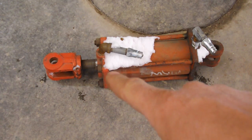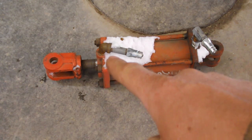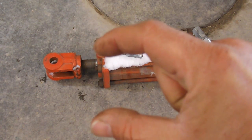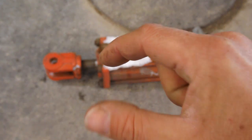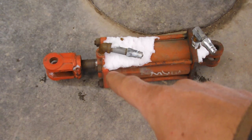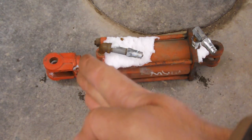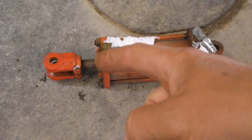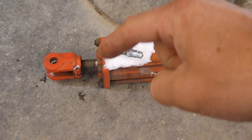What I want to do is basically take off this nut and make a nut that's about this long. I'll thread it onto that rod, put the plate up against it, and then put a bolt going into that spacer I made. I think that's a much better solution. My only question right now is how big can I go and still clear all the casting up here.